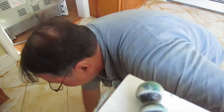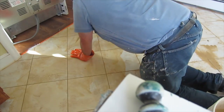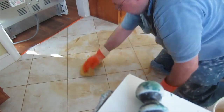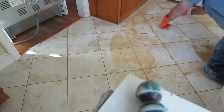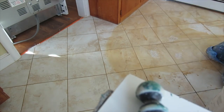You need to clean it up and wash it. Basically, you can use a grout sponge and you're going to wring out as much water as possible. You're going to wash it once, let it haze over, and then rinse it off. Like I said, all these details are in another video I have which covers this in great detail.